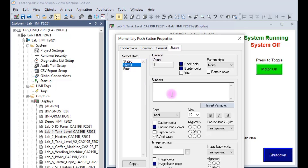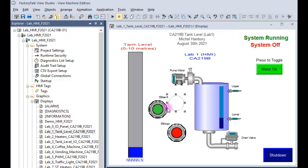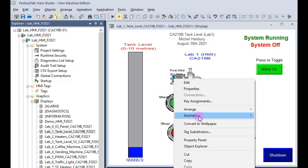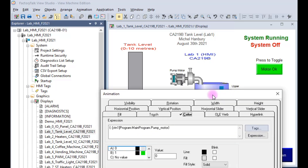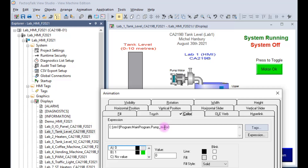If I look at some other information, it tells me that in state one there's actually no text but the color will change, and in state zero that's the back color. The colors change as you run the program. For the pump motor there's a rectangle graphic — I right-click on it and go to animation. The color changes based on the value of the pump motor: light gray when it's off, or brighter green when it's on. That's called color animation — the program causes that point in the graphic to change.